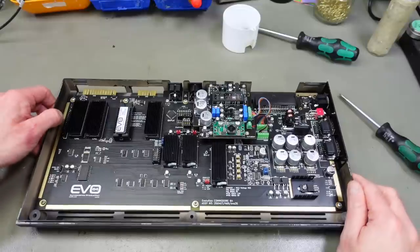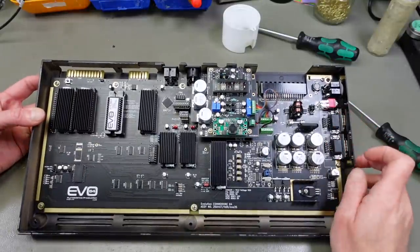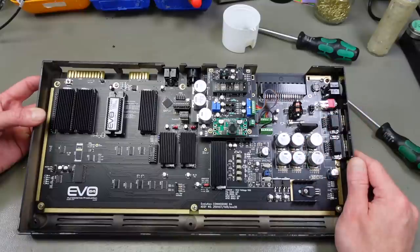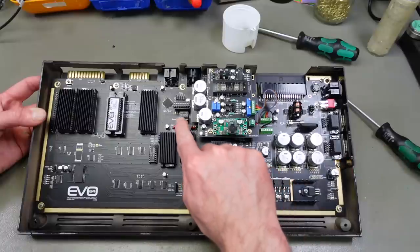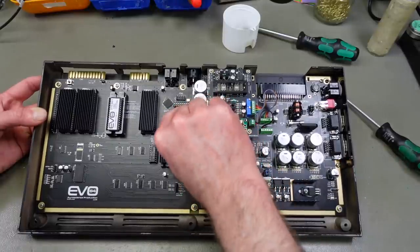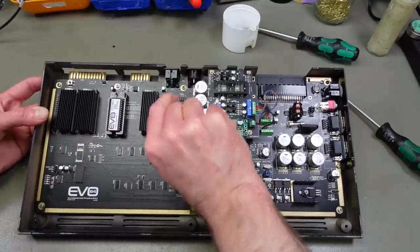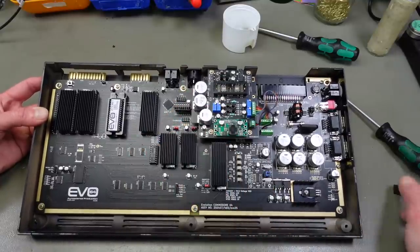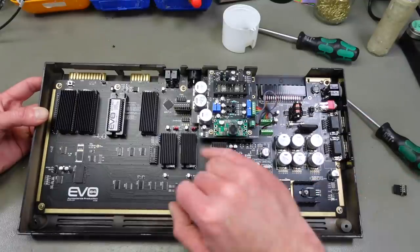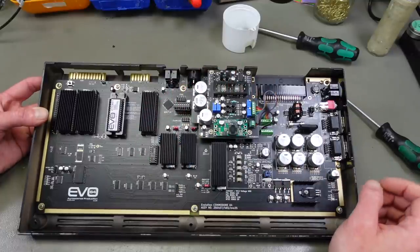So we are going to have to wire our potentiometers to joystick port 2, which is this one, to the pin headers we put in there. We are going to have to wire 2 switches to this row of pin headers. If I remove this dip switch, we should be able to see. There's pin headers underneath, so we can easily just plug in there. One switch is going to be for this JTAG header, putting this into cartridge mode.